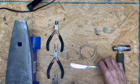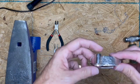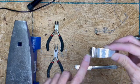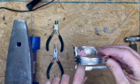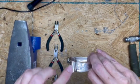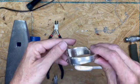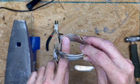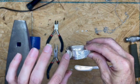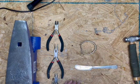To get started, I marked my knife at about five eighths of an inch. If you haven't hammered any of your flatware before, the reason we're going to mark it — and not hammer it all — is because I wanted the contrast between smooth and hammered. If you hammer these, this part gets all mottled, so to keep from ruining that, we just don't hammer it.